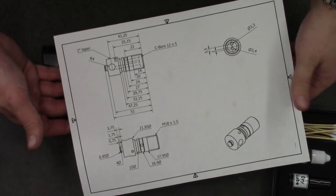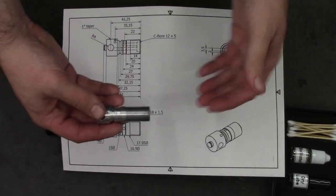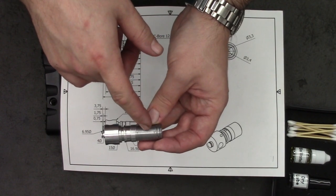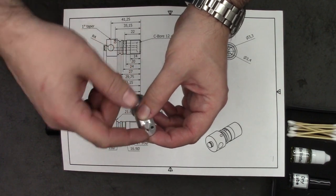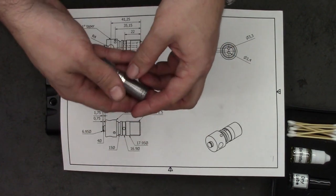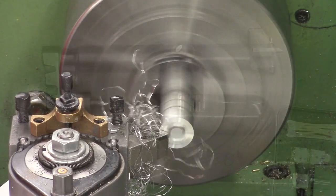Here's a quick look at the drawing I made for the part. The prototype is pretty much identical to the Edgun original part — the only real differences are that the thread is a little bit shorter and we have a rebate counterbore in this end, so the one-way valve and air passage sits back from the face a little. With that out of the way, we'll move over to the lathe.